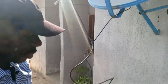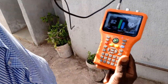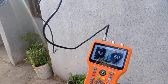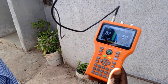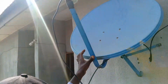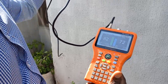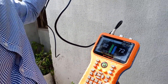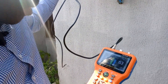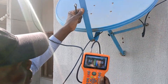The signal quality is at 60. To increase it, I can twist the LNB — but it has dropped. I can still move it a bit. You can see it's increasing and has now gone up to 72. However, understand that you don't need to give this signal too much quality, because if it's too high you won't be able to get Badr 26E. The idea is to reduce this a bit so that the 26E signal can come in.